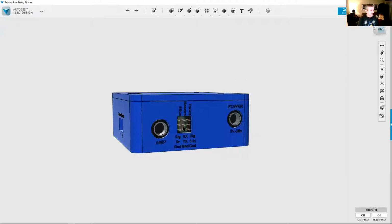The Maestro is in the center. This is where you have to pay attention to the RX, TX, and the ground. And then we've added this future development here that we're working on for animating R2. We'll be able to add a potentiometer to his dome that can tell where his center front is, so we'll be able to do free animation on R2. You'll be able to flip a switch and he'll go into free animation mode. So if you have him sitting over somewhere, he can look like he's still alive and move his head and play sounds. That would be awesome.